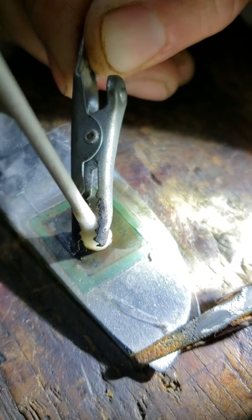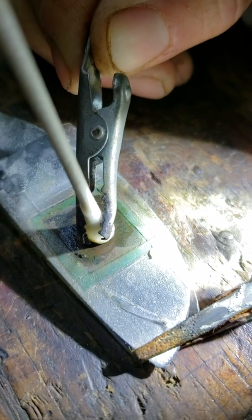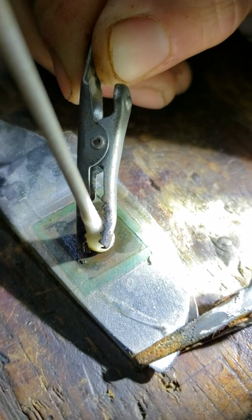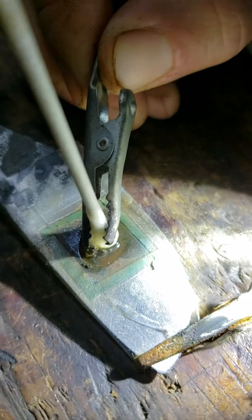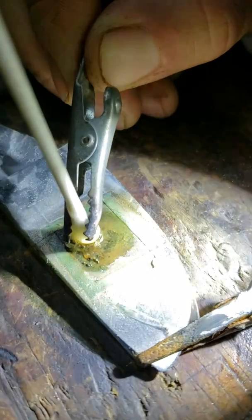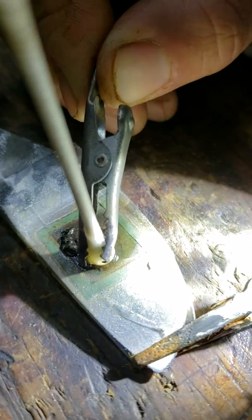Yes, once again, the smoke is probably not very good for your lungs. I don't know the chemical makeup of it, but it does make you cough. You could either do this with a fan blowing against the etching away from you, or wear a respirator. If you see the black forming in the electrolyte solution, that is the steel being pulled away from the knife.